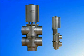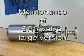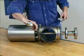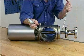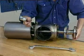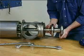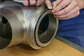Now we will demonstrate maintenance of the large version. The tools shown are required for this maintenance. The maintenance of the lower clamp, lower valve body and plug is done in the same way as for the small version of the SRC. Unscrew and remove the valve plug. Remove the seal ring.